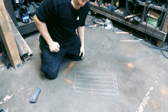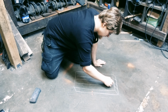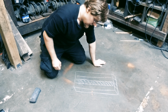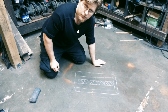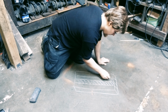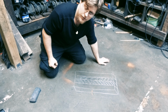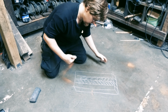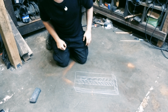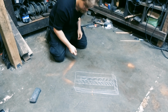Now the two twisted pieces of Damascus steel are going to go in the center of the billet. One will be a clockwise twist, and the other piece will actually have to be a counterclockwise twist in order to achieve this directional arrow sort of pattern. That will be twisted the other way, because if it was twisted the same way, I'd just get that same effect the entire way down. I want that to be a little bit different. And when I go to grind the profile, there's going to be a lot of hollow grinding involved, but I'll get into that later once I've made it.